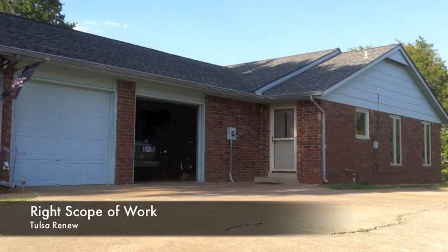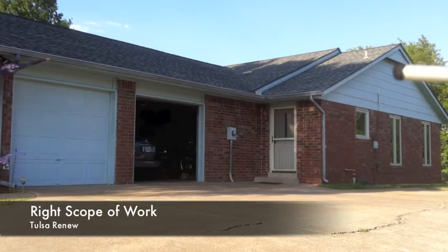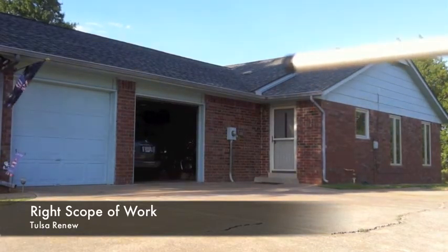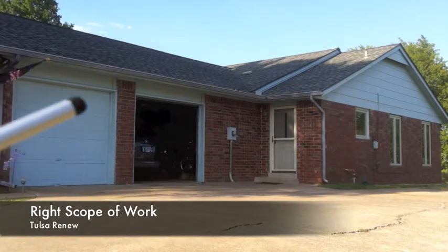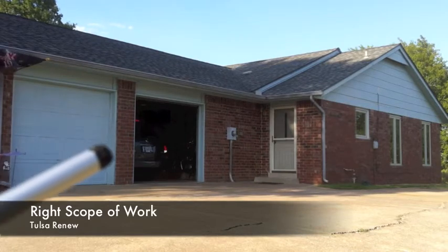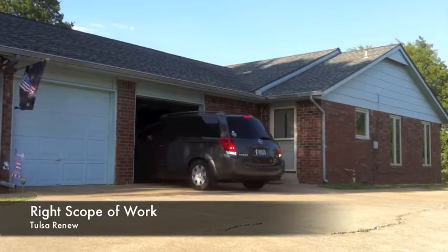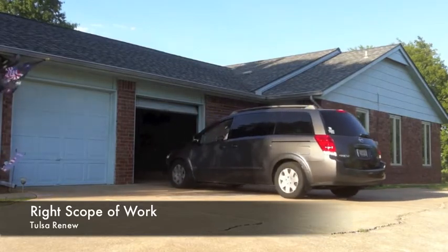So here on the right side of the house, we'll be doing the same scope of work as the front gable to this right gable, taking the vent down if you'd like, doing the fascia overlay in the areas that do not have gutters, and doing the fascia overlay in this little slight gable right there. On the garage doors, we'll wrap the garage door frames in hardy plank, replace the trim right next to the garage doors with the same thickness of trim, so it's about a 1 inch, so we'll use a 1 inch piece of hardy for that area. And we can hide those wires in the wall and make them disappear, so it'll look really clean.